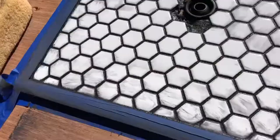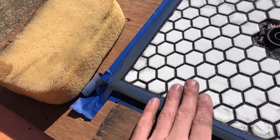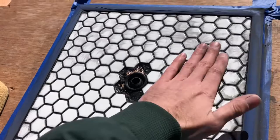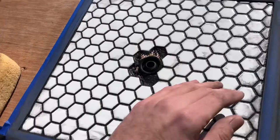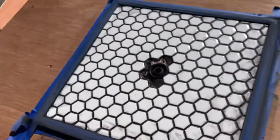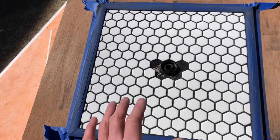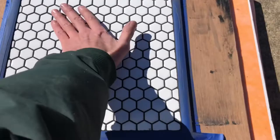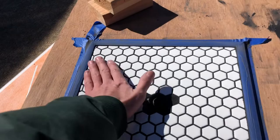There's a point when you're putting in grout that you just can't keep wiping it, because it'll just keep pulling grout from the inside of the lines. So you get a very thin film — just let it dry. And then you can go back with either a wet sponge to get rid of that haze, or some grout haze remover which comes in like a spray bottle. But anyway, that's how you tile something. After that haze dried, I went over it one last time with a very lightly damp sponge — barely any water on it — and then right after that went over it with a dry sponge. And that looks pretty good. I won't even need that de-hazer.